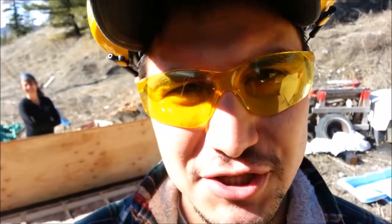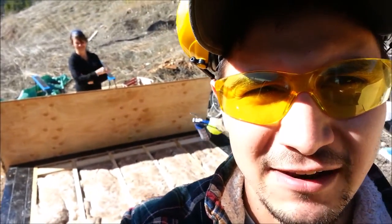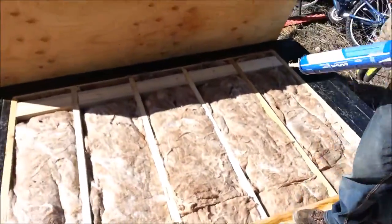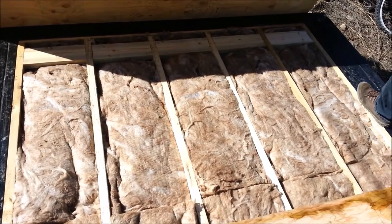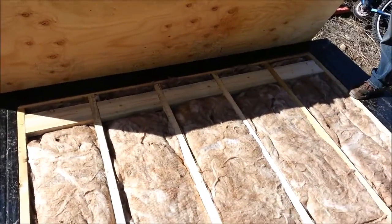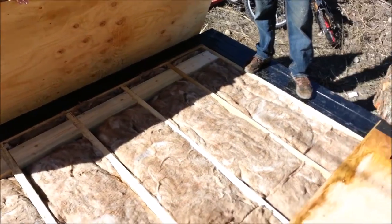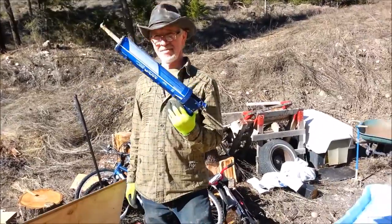It's another beautiful day here in Esket. We're in the process of laying the sheathing down now. If you can see right in the background, we have that one sheet — we left that off just to show you what's happening. What you can see down in the floor is basically your standard sheeting glued down to the joist and also to the steel. We're going to slightly overhang the last piece to increase the inside wall. Alright, here we got Don — you ready? Here we go.